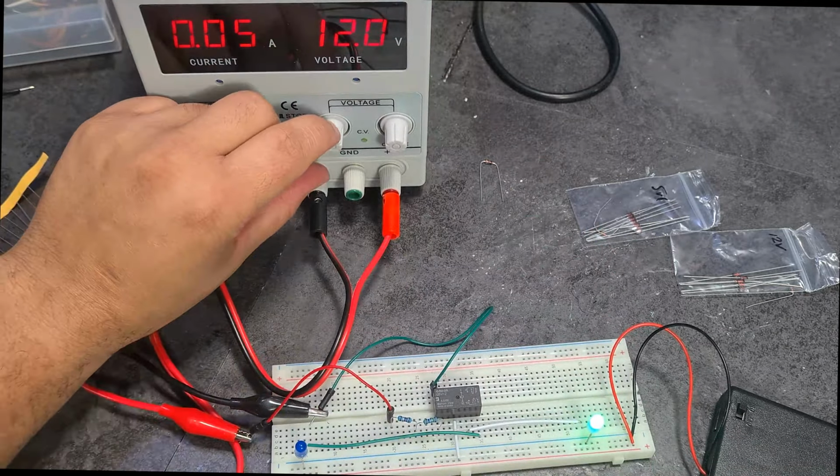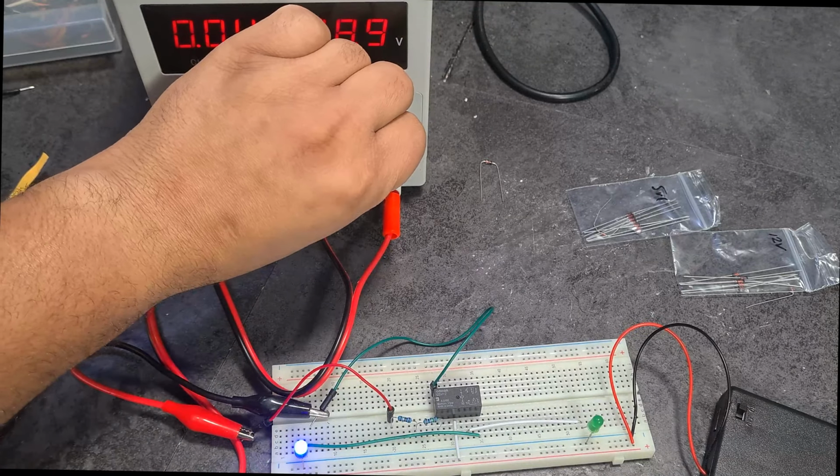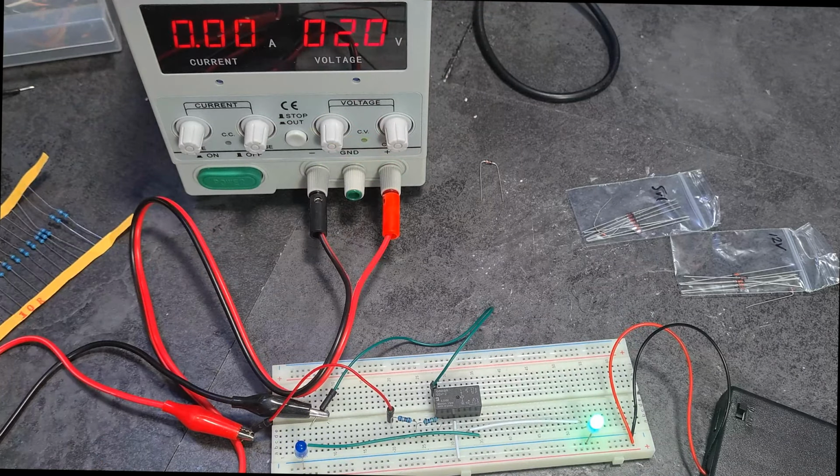Yay, 12.1 volts. And it switches over. So I'm guessing I need to figure out what voltage I want my battery to be at, and then I don't know the calculation for it, but basically I could use trial and error to figure out what resistance value I need in order to trip and trigger the relay at that voltage value.